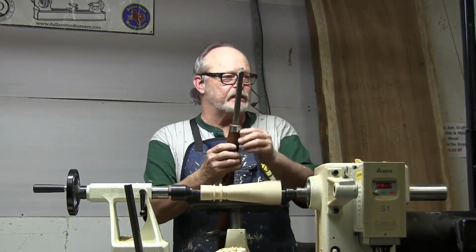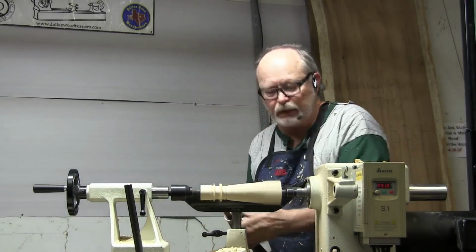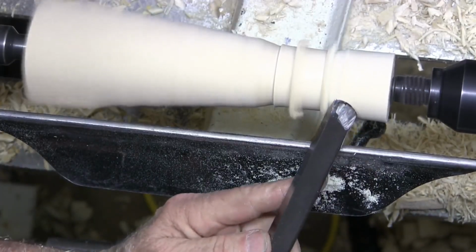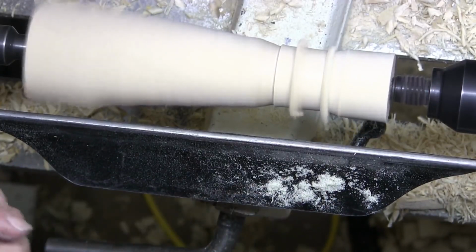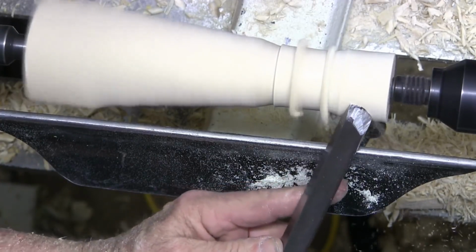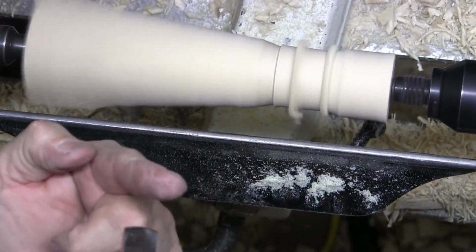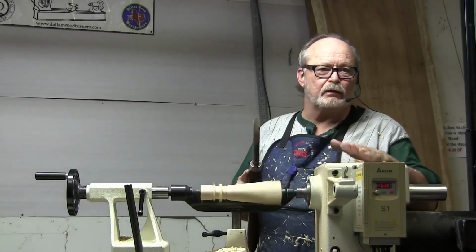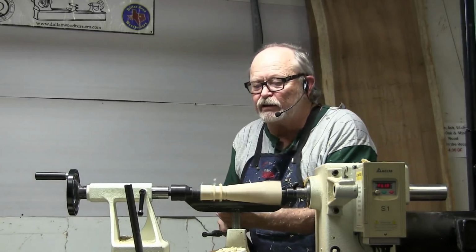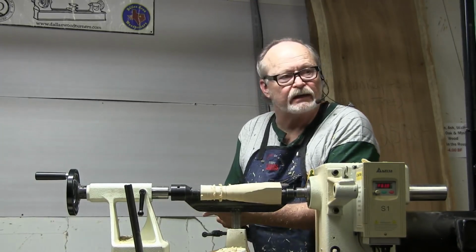So here's the physics. Draw a line right through the middle of the tool, its axis. When I present it in planing mode, when I'm in the lower half of the axis, it's supported by the force of the lathe. Doesn't look like it, but that's what's holding it up there to work. It's just balancing on a single point here. As I come across that, it progressively loses support. It doesn't happen all at once. When you get into the upper 1/3 to 1/4, that's a classic dig-in.